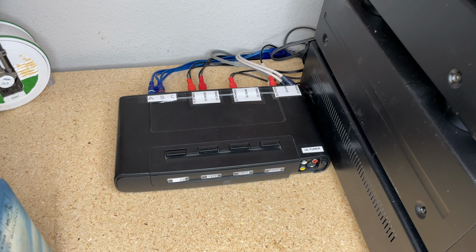And then I've got combined outputs there, those blue adapter cables that allow the multiple inputs to be reconnected back into one. The only problem I've had with this setup is I think I might have blown out the preamp on my first LP3 because I had 2 turntable outputs connected to them. And the LP3 is in a constant on state, so you can walk up to it and touch the stylus and you'll hear it because it's always on and amplified. So unless you have a switched power preamp, you're outputting that voltage. That's not an ideal situation. That's one reason why I keep 2 sets of speakers. And speaking of speakers, let's go over to that side.